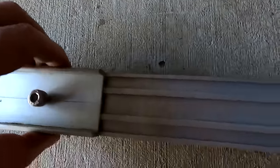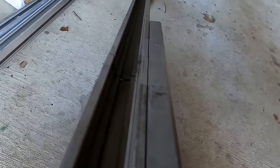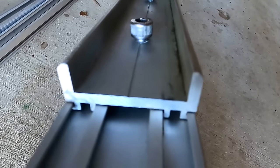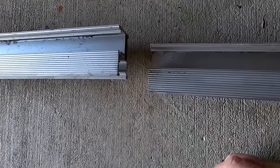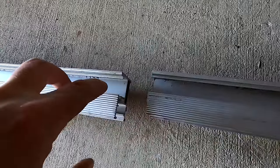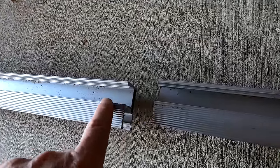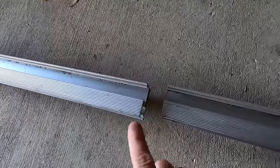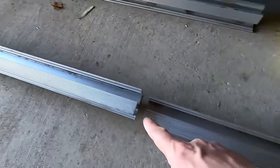This is the original joint from the rail system manufacturer - it slides into the rail system and you use two screws to clamp it, joining the two pieces of aluminum rail. This is a valid earth connection because it comes from the manufacturer. But if I use my own joiner - a square aluminum bar that exactly fits into this gap with two screws on each side and star washers - apparently this is not enough to make a proper earth connection. In this case I'm totally disregarding the regulation and will join these two with the aluminum bar inside, using only one earth lug for this rail despite having two joints.